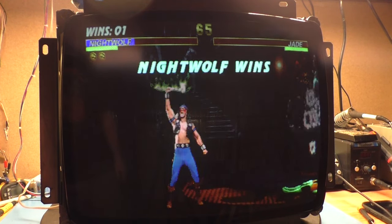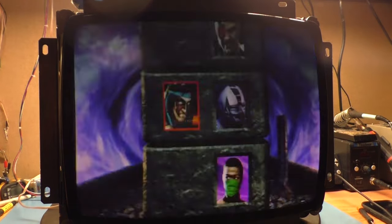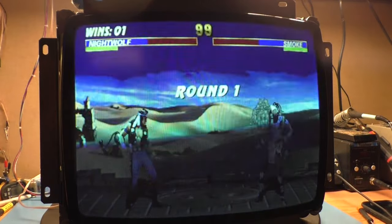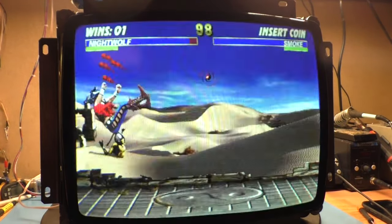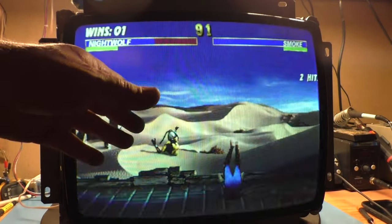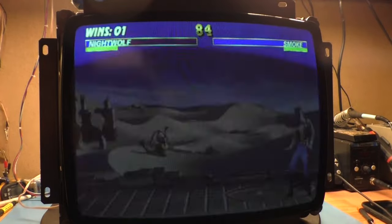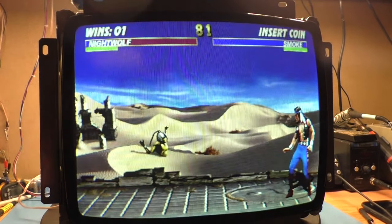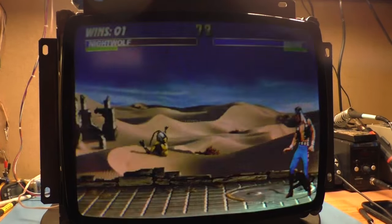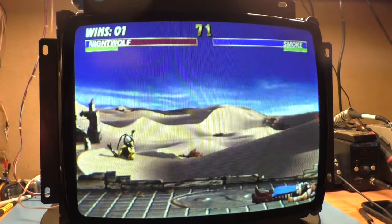So, yeah, after I do the cap kit and the reflow, I'll let it run for a little while. Because, I mean, it probably hasn't been run in so long, the guns have some junk on them. So we had a shorting green gun, and then we had a shorting blue gun. Now I'm waiting for the red gun to short. So anyway, before that happens, I'll go ahead and shut this off, do the cap kit reflow, let it run for a while, and we'll call it good. So barring any unforeseen circumstance, we'll call this done.